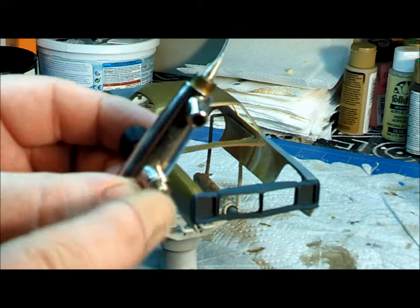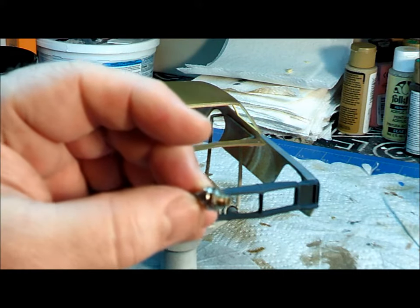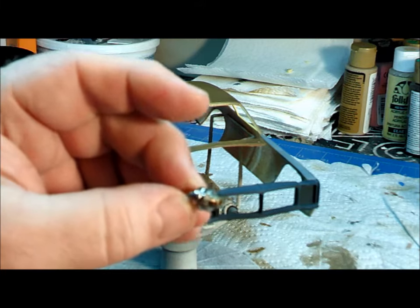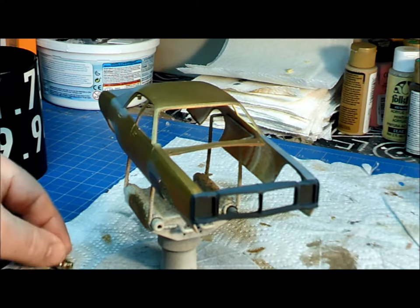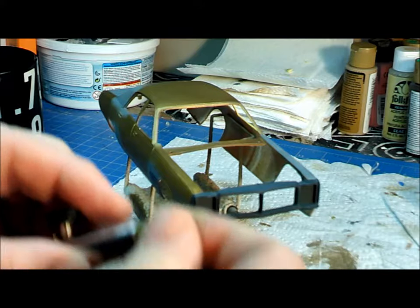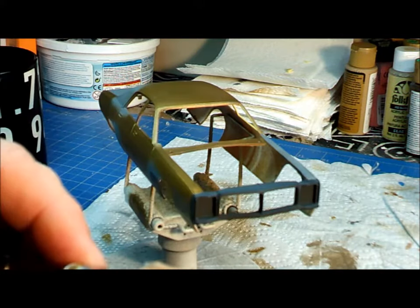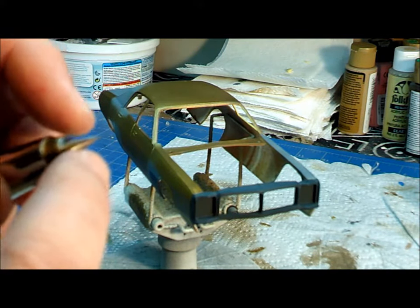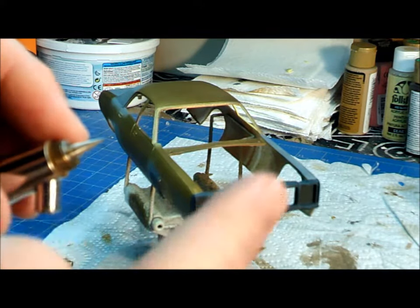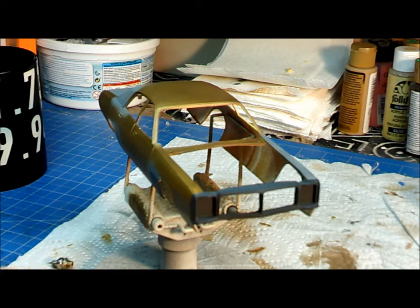Over the years of washing and cleaning, I figured the o-ring in here might be going bad and the pin was wearing out. So I decided to replace it — wasn't expensive, maybe eight dollars. I also replaced the cone — this medium-size one. It comes in three sizes: large broadcast, medium, and fine for fine lines. The needle had been sticking out too far through the cone, so I bought a new one. Both parts came in recently, so let's give this a shot.